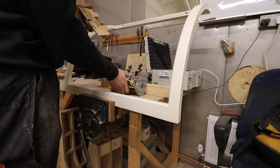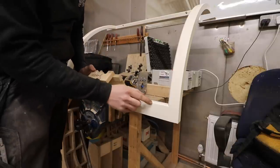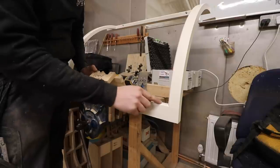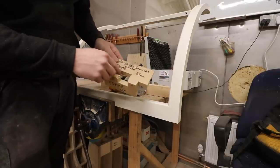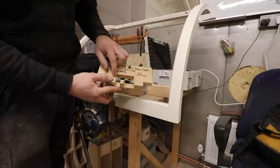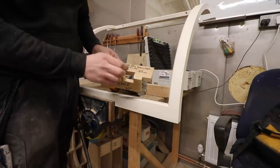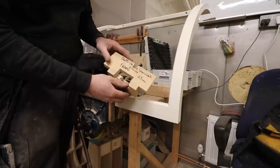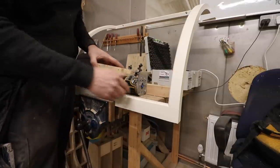These frames require two jigs to do the hinges because the doors sit back the 5mm of the bevel of the frame. So I've made one jig that routes the deeper cut for the frame, and I've got a separate one that does the cut for the door that is about 4.5 to 5mm less in depth, so that the door sits in the right position on the frame.